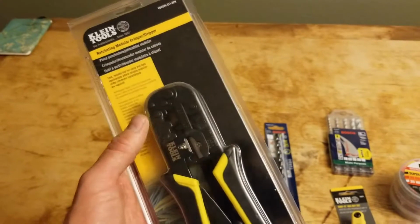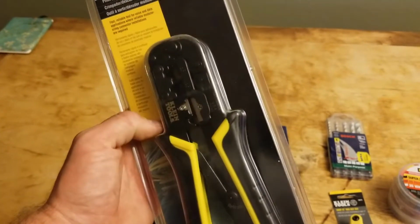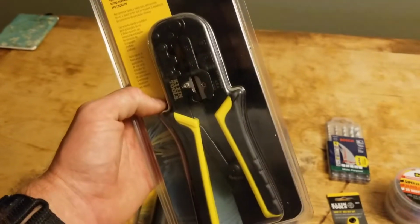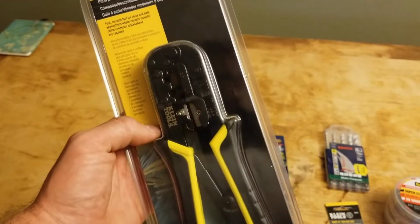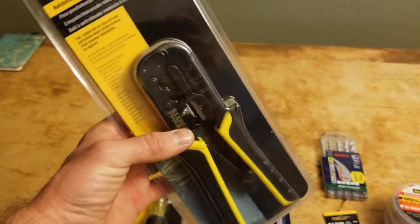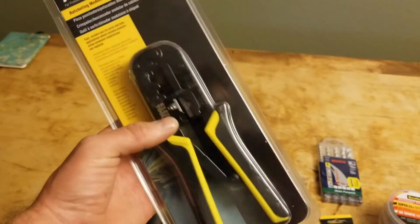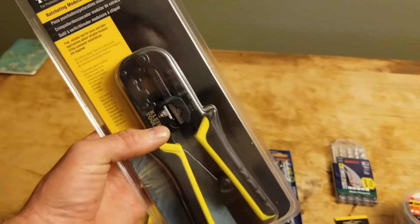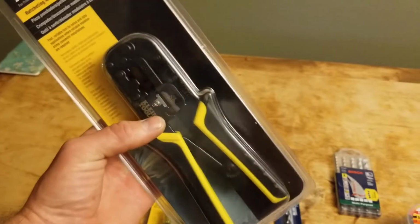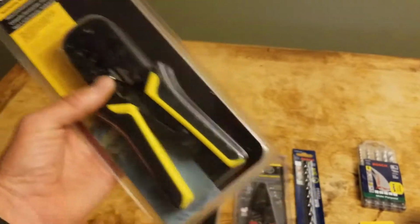The 6-pin plugs, RJ11s, have a tendency to require a bit of force to insert them into the tool, and as a result, the wires can back out or cross over and short out inside of the plug, resulting in a bad crimp. And much frustration. So hopefully this will alleviate that issue. If nothing else, I'll have the other crimper as a backup.